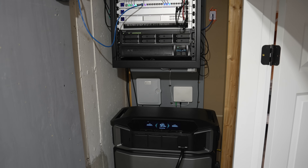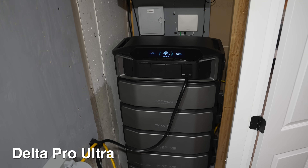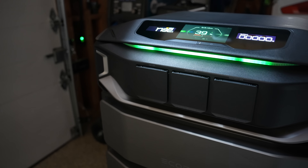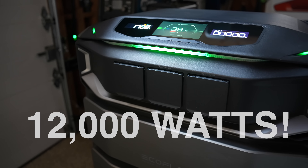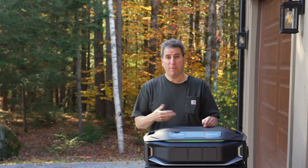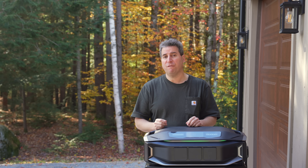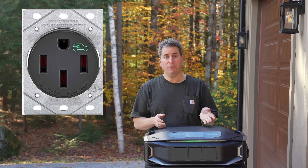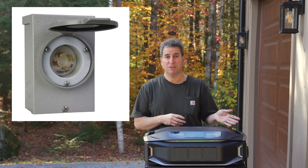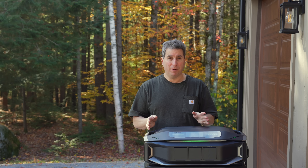The old one was just called the Delta Pro Ultra — I've actually shown you guys that in a lot of my videos. That is the system that runs my house during power outages. For the first time in history, EcoFlow has produced a single device that can output 12,000 watts of electricity continuously, which makes this model more powerful than pretty much any gas generator you can buy. That also means you're going to need a 50-amp circuit, so if your current setup only uses a 30-amp, that could potentially be something you'd need to upgrade.